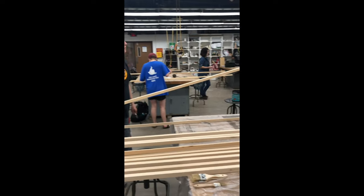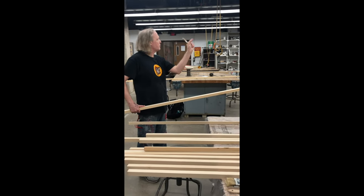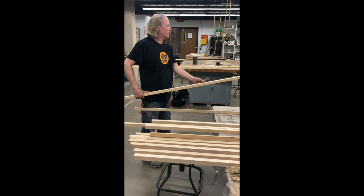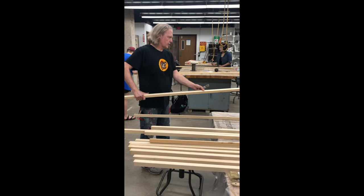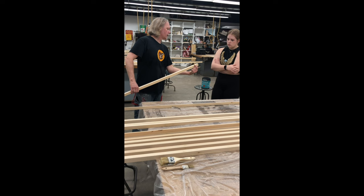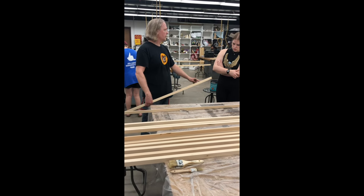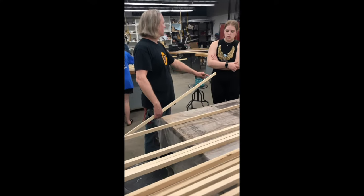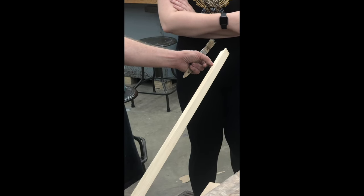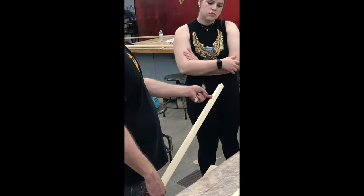If you look at the shape, it's kind of like an upside down L. It's got a really thick vertical part. It's called a cap. There are other weird names for profiles, like swans and ducks and other things, but this is just a common cap. We're gonna paint the back, the top, the front and inside of the lip, and the inside. This area in here is called a rabbet. If you're dealing with someone about a frame and they ask how deep is the rabbet, you can tell them it's about 3/4 inch deep. The lip would be about 1/4 inch here.